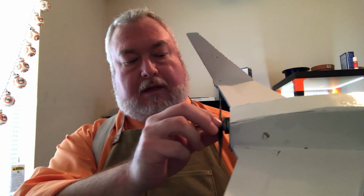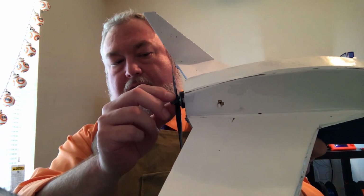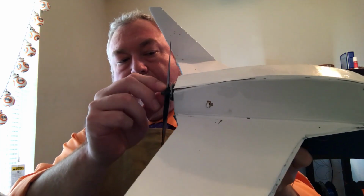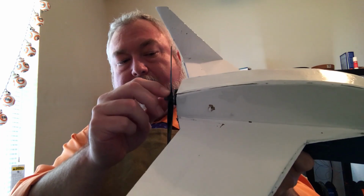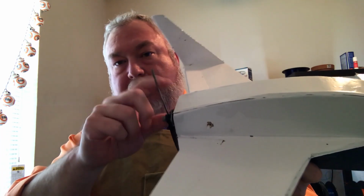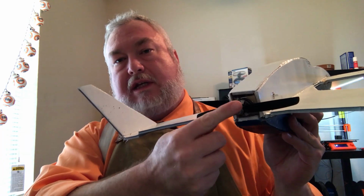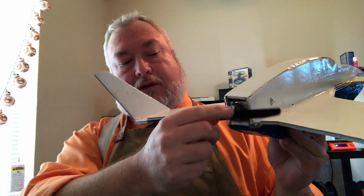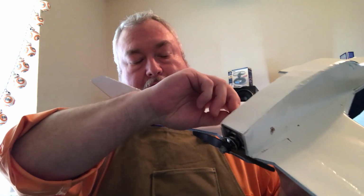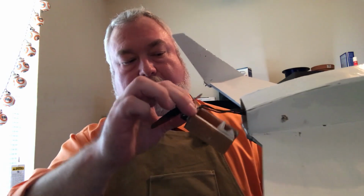So I am going to attempt to fix this wobble, which I think is what's happening. It's moving and when it gets some power, that is screwing things up. I put a little piece of paper in there to get it to stay down, but that worked temporarily only. Now the paper slid. So this motor mount was designed to slide out, so we're going to do that.